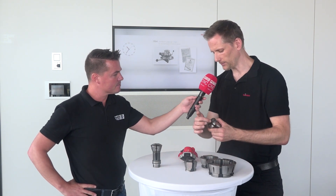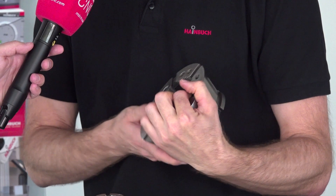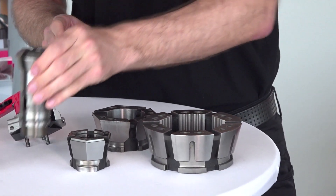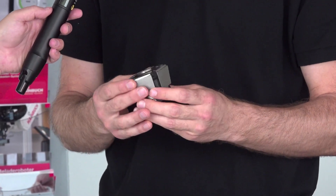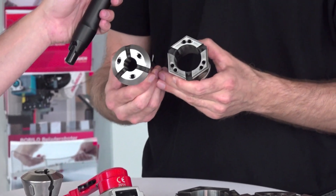You have multiple options for multiple setups for that quick change depending on what's going on with the customer. Exactly — there are many options for the clamping head: with serration, without, with different types of serration, or smooth for finished surfaces, and also different shapes — hexagons, square, whatever. For example, this one here is with a gear module, module 2.5, to clamp a gear wheel. And the next evolution step was having the hexagon on the outside, which is better against vibration and better resistance against contamination — for bar work or milling, this is the next evolution step.